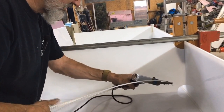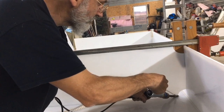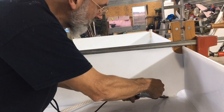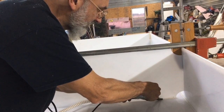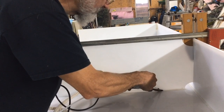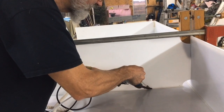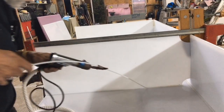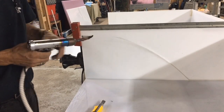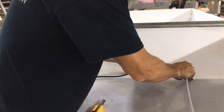In this weld, we're not concerned about water stability or leaks, but we still want to make a really good weld for strength. Sometimes it happens that you have to stop mid-weld to do something — either reposition or you're burning your hands. In order to do so, the easy way with this type of welder is to simply pull off and pull all the way off the rod. When you want to start up again, you insert your rod back into your welder, go back down to where you were, and simply start over again.